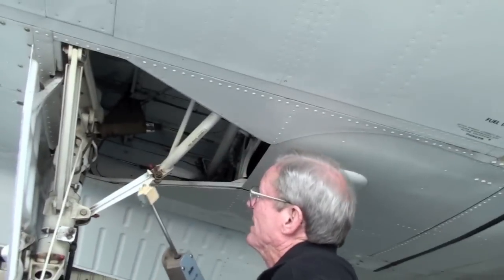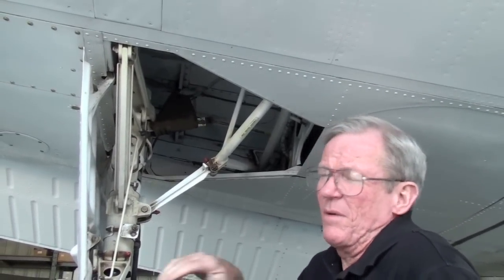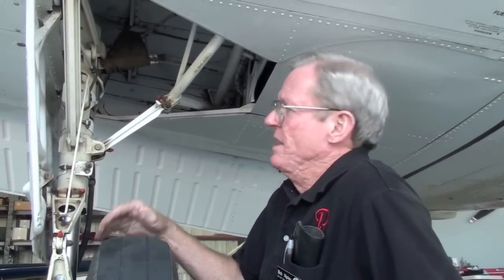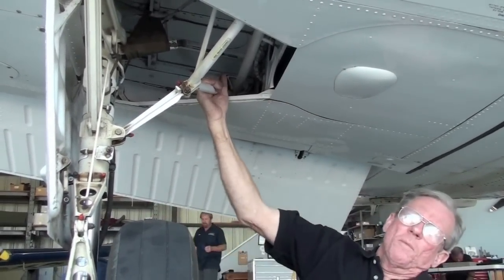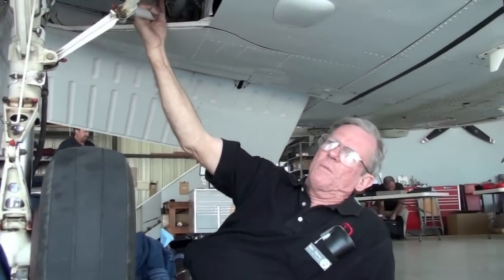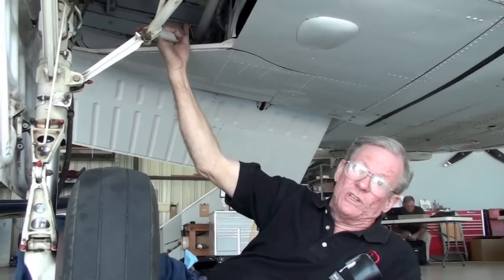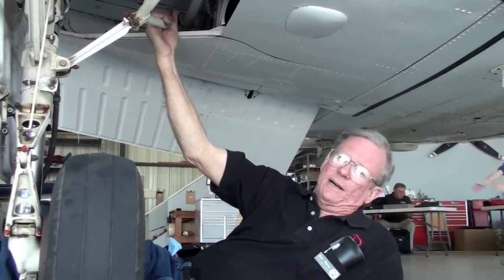You said that the 53, was it 53 here? 56 and 58. 55 is the minimum down lock tension on the nose gear. You've got it right over here. Okay. 45 to 65 is the mains. That could be a couple of issues. Normal tension, if everything is set up right, will be somewhere 65 to 70. It could be the up tension may be too tight. The spring may be getting worn and need to be replaced.